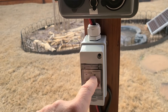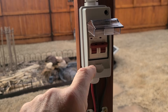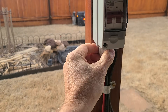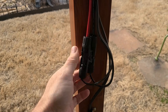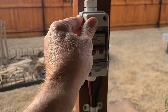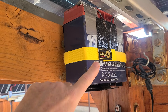I tightened up the screws on the circuit breaker where the wires go into the bottom and top. For 20 bucks it's a little added protection. For the MC4 connectors, in case I want to swap things out, I'll leave those dangling right here. I secured the cable so it's not going anywhere. It's a 12 volt system with the Dakota Lithium battery up here — this has been working great.